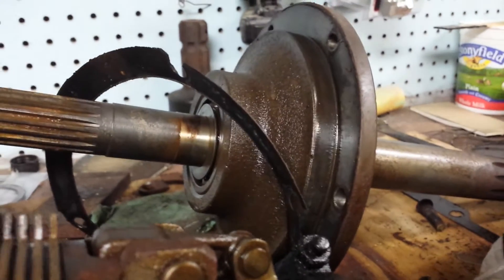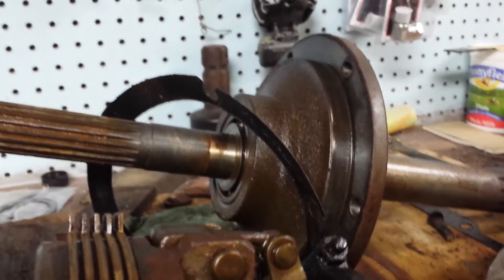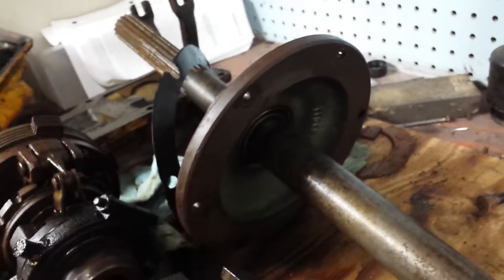This shaft goes into the housing, in front of the housing — I won't be able to show you very well because of the way it's turned up — but notice there are some shims. That's how you set the preload for the bearing, with shims, so keep track of those. That's what you would see when you look at the housing and take that cover off.